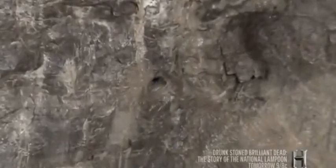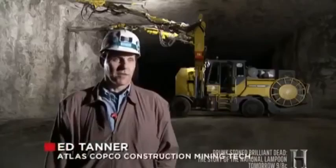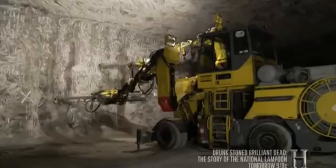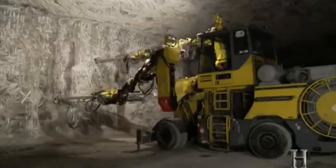Holes are drilled into the surface, and dynamite is inserted into the holes to blast material from the face of the solid rock. The Rocket Boomer series of drill rigs can be used in a wide variety of hard rock mining applications. The machine weighs approximately 90,000 pounds as you see it, and has a reach of about 55 feet wide and about 45 feet high from a single setup.